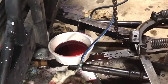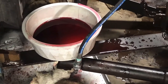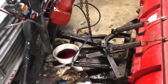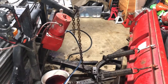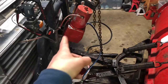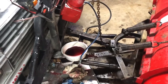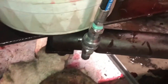I'll probably spin off the quick disconnect to check. First I'm going to have my wife come out and operate it to the left while I push down on this fitting, because the quick disconnect may be faulty — though I don't think that's the issue. I'm pretty much past the point of air bubbles; I've done this three or four times lifting, going back and forth, dropping the lift ram, filling fluid. It's been overfull at times, so there is pressure — it's just not getting through. When I disconnect the fitting I do have fluid there.